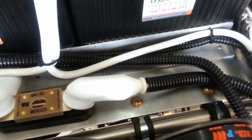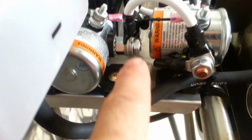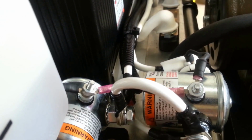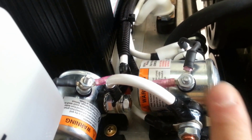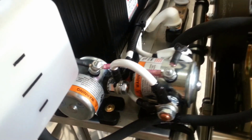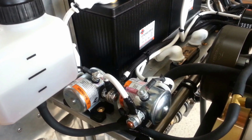So, moving along, you are now through your shunt if you wanted one, and then you have your fuse, and then the alternator cable continues on and terminates. This is easier to see on the wire diagrams, but basically you have a cable jumping from here to here, and that's the output of the solenoids, and that's the area that is distributed to the airframe, and also where the alternator charging will come in, so that when this one's closed, it charges a battery, or if this one's closed, it charges another battery. So it's the jumper between them. And that covers the alternator installation, other than, of course, studying the main cables that are associated with it on our website in the wiring diagram section.